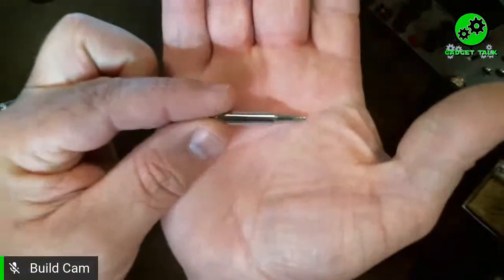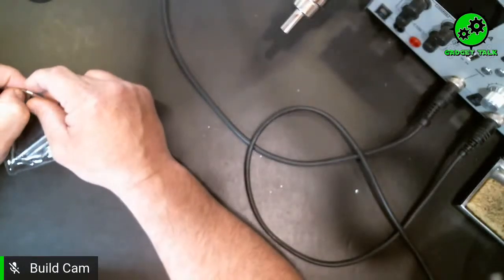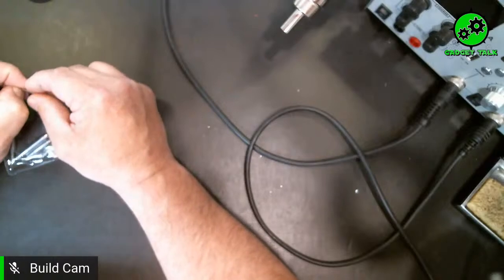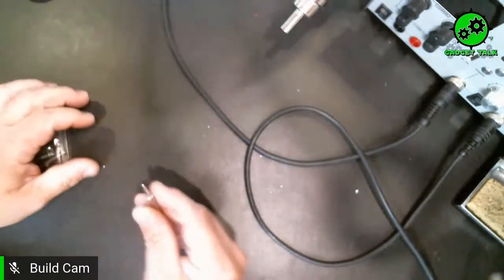An untinned tip looks like... You have a picture of that, right? This right here. Oh no, that's actually a burnt tip. What would cause a burnt tip? Oxidation. I honestly don't know what caused it. I went to use it one day and it was like that. I don't know if I left my gun on for a long time and it just was heating, or if I stuck it on a wet sponge or something, or if my son used it. But typically abuse of your tip is what will cause that. So it oxidized and ate itself away. That's not a good tip.